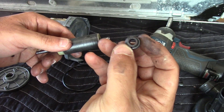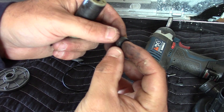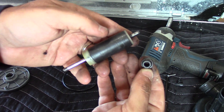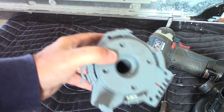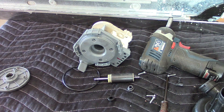These bushings are really the only thing you need to replace, but I couldn't find them anywhere to source online — it's not really a replaceable part. So the easiest way to go about it is just to order a complete new circulation pump, and that's what I did.